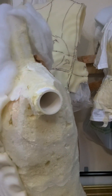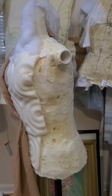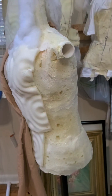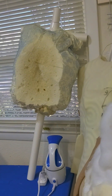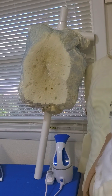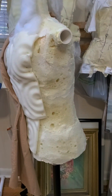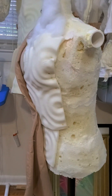Then we place the PVC pipe inside the case and spray three-inch expanding foam into the case. We learned by mistake that we can't put all three cans in at one time — it'll blow the pattern out. So we add one can at a time, let it cure, and then if we need to carve it, we use a bread knife.